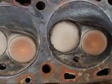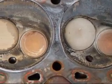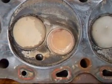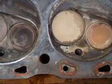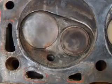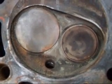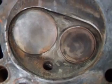Taking a closer look at the cylinder head, you can see that the valves are of good color, meaning that the engine was running properly. But we do see on this end cylinder a little bit of discoloration and not quite as much ash deposit as we had on the other valves. So we're going to start with that cylinder and see if we can find a crack.